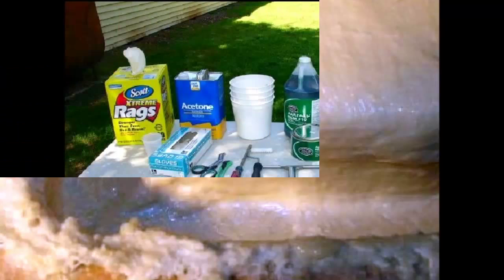But the support shell could easily be made of the Cast-Right gypsum plaster, but it would need to be about 3 inches thick, and that means it would be very heavy. And since I have to make 52 castings in concrete when the mold is finished, having a lightweight shell mold will make concrete casting easier to handle.